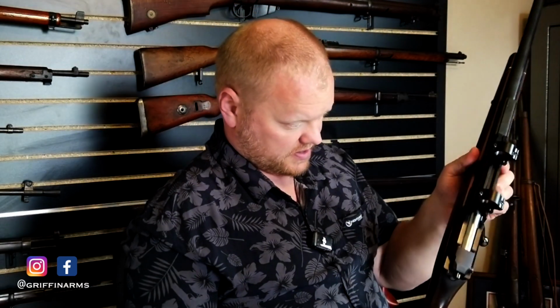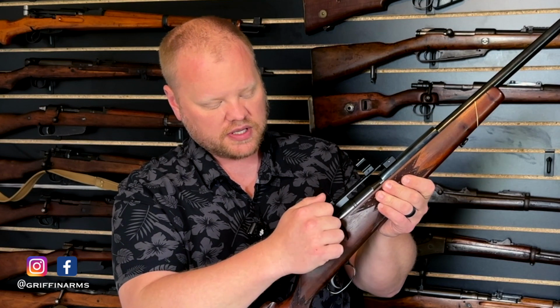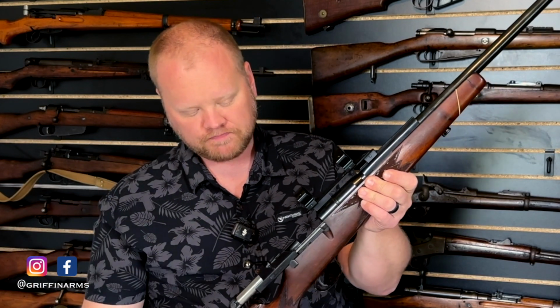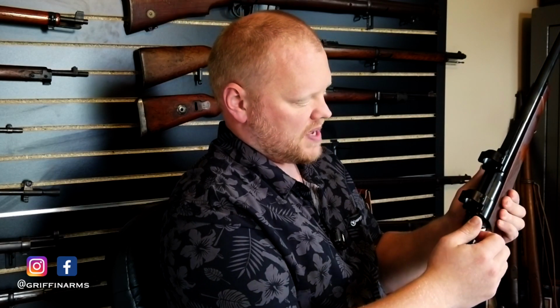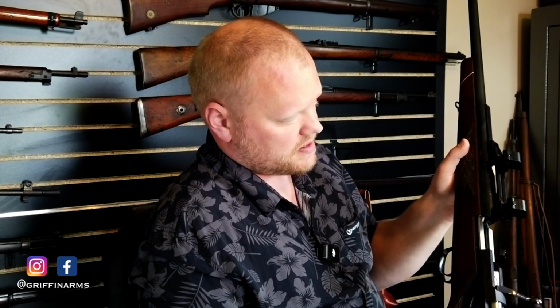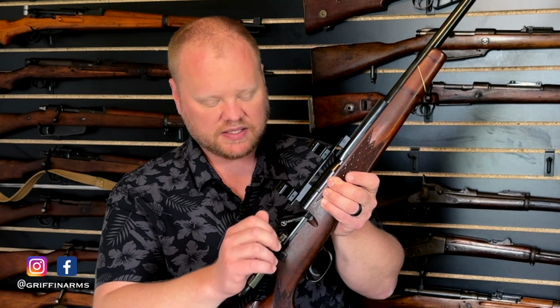This Mauser 66. The Mauser 66 uses a telescoping action, a short telescoping action. So you have a short bolt that you would use for intermediate cartridges, but you could chamber Magnum cartridges because of the way that this whole lug here toggles back, giving you twice the room and keeping the bolt just as tiny as possible. So it's basically an innovation that was the K98 come together with modern technology and modern types of engineering, shortening the action, providing a very, very robust and tough gun.